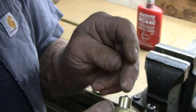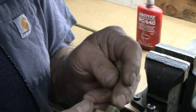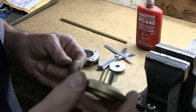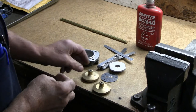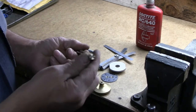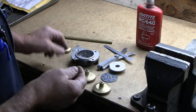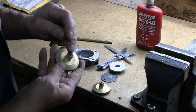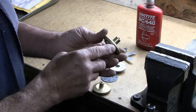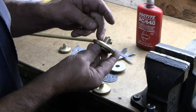So I can't just drill an eighth of an inch hole here and make a little fitting and glue it in there. There's nothing in there to hold it. There's not enough surface area to connect anything to. So I'm going to make out of some 360 brass bar stock an insert. I'm going to center drill and tap, center drill and bore from this end down in, at least a half an inch or so,